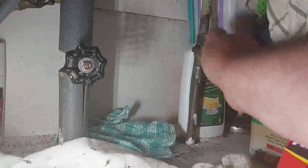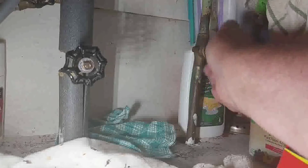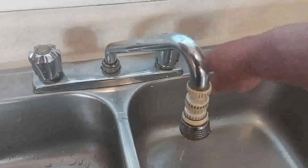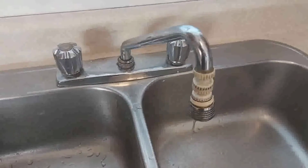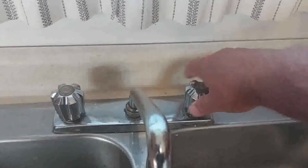So these gate valves are old, and they're soldered in here into the copper pipe. Most likely you got a different valve than I have. Now they're both off. So open the tops to drain any water here. So we drained the line, now we'll shut the tap off. This one goes the opposite way, of course.